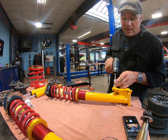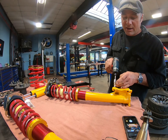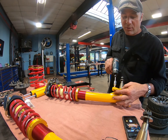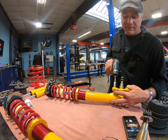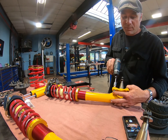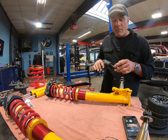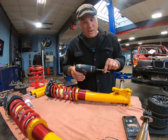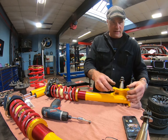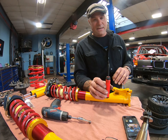I generally go through it twice. If I don't get it lined up perfectly it just stops, so you back it off, try again, find your correct thread, run it all the way through — I like to put my finger on the back side — then back it right out of there. Those have already been done so they're not super messy. The other thing I like to do — there's a little reaming tool that is designed for cleaning up the edge of sheet metal after you drill it.